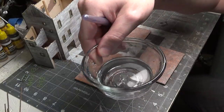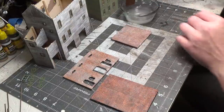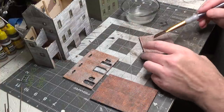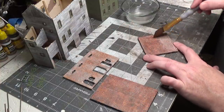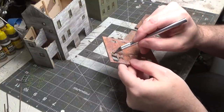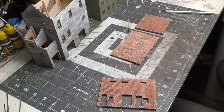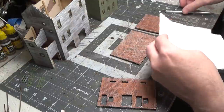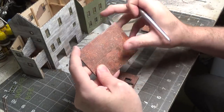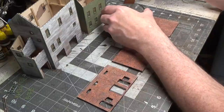I've got some clean water and a wide brush. Rinse your brush good — make sure that joint compound is out. You do want to go in and clean up all that extra joint compound. I just went over the walls again and washed off the face. You can go over it as many times as you want — just make sure you get clean water each time you do it.